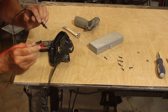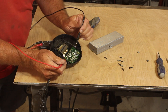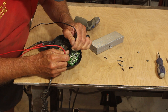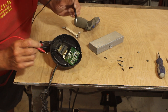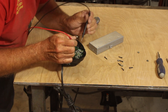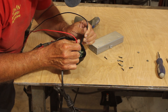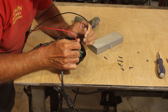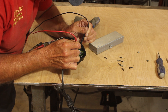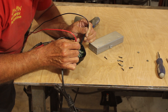So here we'll just follow this circuit. We'll take a look at the transformer output first, which are these two points right here, and it's showing me 12 volts there, which is good. And these three points are labeled and that is giving me nothing, that is giving me nothing, and that is giving me nothing.